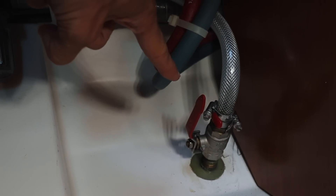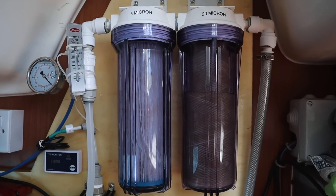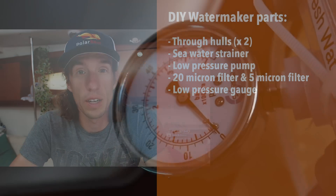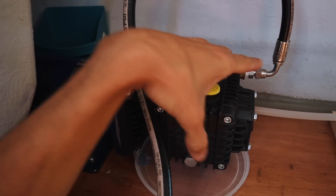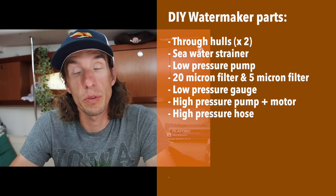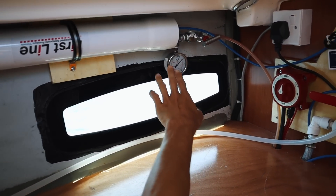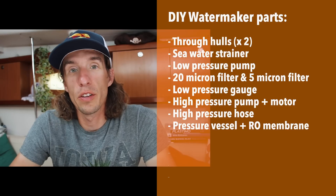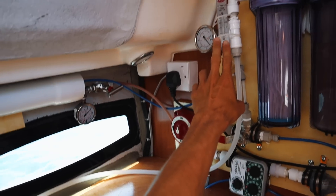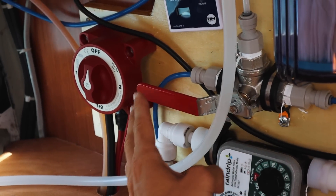On board PolarSea, these are the parts we used to assemble our DIY water maker. Two through-hulls: the first to allow seawater into the boat, and the second to allow brine discharge out of the boat. The seawater goes into a seawater strainer, followed by the low pressure pump, which feeds water into our 20 micron filter, then our 5 micron filter. After that, a small pressure gauge lets me monitor the low pressure side. The water then flows into our high pressure pump, powered by our high pressure motor, and that flows into our high pressure hose — which must be capable of handling the pressure the pump is putting out. It then flows into the pressure vessel housing our reverse osmosis membrane. After that, a small control valve and a monitor. From there, water goes two ways: brine discharge overboard, or fresh water. The fresh water goes to our flow meter, and then to a three-way valve where we can select if the water goes to the sink or to the tanks.